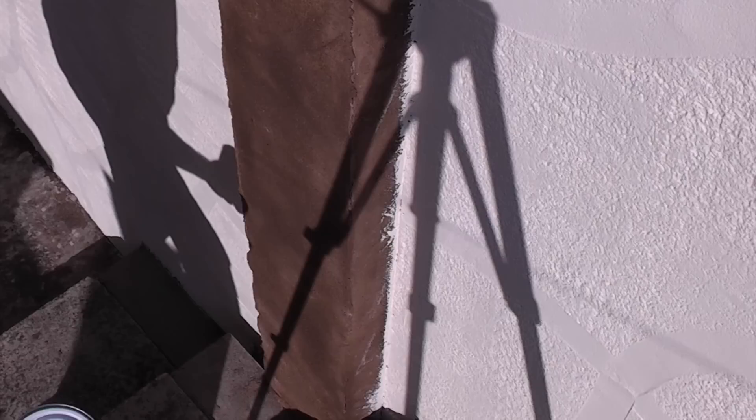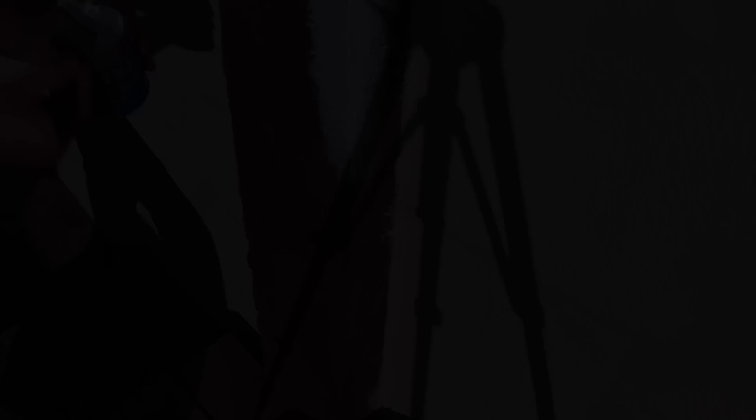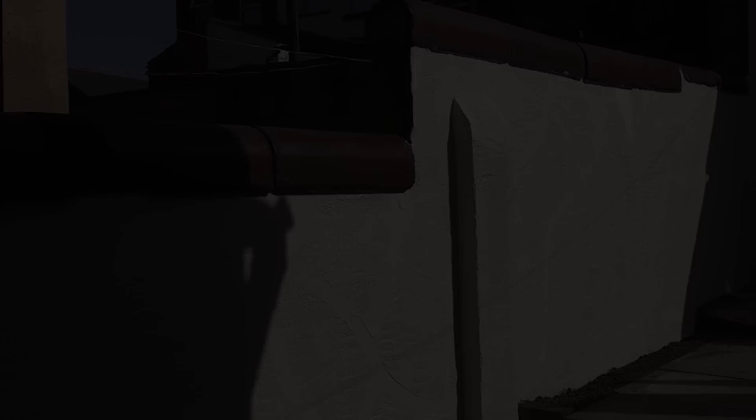Like all paints, you need to read the instructions first. Now we're just going to get a paint brush and paint down the corner to seal it and prevent any future problems. You can see we've now painted both of the edges where the galvanized angle bead is. The good thing is that particular stain block will be dry in 30 minutes, so in 30 minutes we can give it a coat of the masonry paint. When you're finished you should end up with a wall looking something like this.